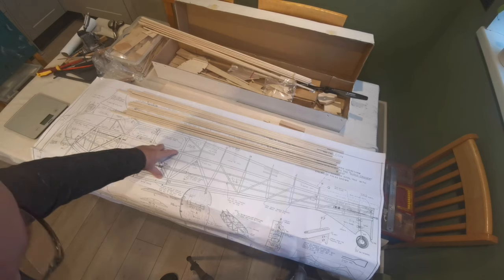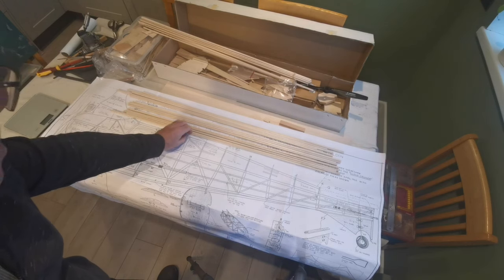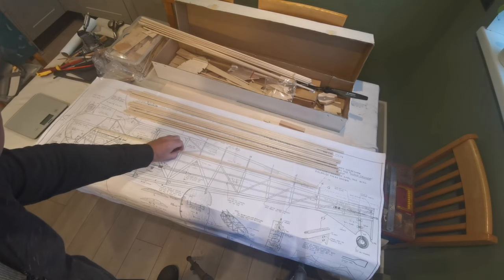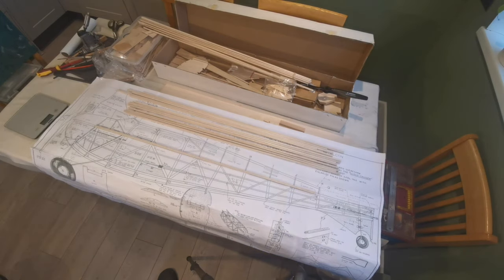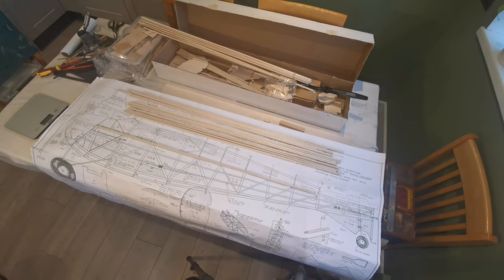The main task is to make up two sides like this. However, the very first task is to sort out the balsa itself. The obvious issue is that the balsa isn't long enough — the same issue I faced with building the wings. In a big model you're unlikely to get balsa of the required length, so I'll have to make longer lengths by producing a scarf joint. That's not a big deal and I'll demonstrate how later on.